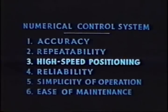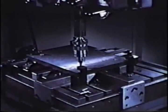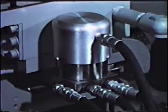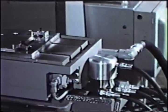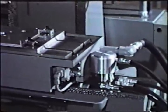High-speed positioning is another time and money saving feature of the Sperry numerical control. The Sperry control can actuate a table, carriage, or tool post at speeds up to 200 inches per minute. It can maintain its positioning speed right through to the final position where it is hydraulically locked — no special clamps being required. The Sperry control has been designed to accommodate all travel speed requirements of normal shop practice. To achieve high-speed positioning without sacrificing accuracy, Sperry has developed a special electro-hydraulic valve — an exclusive Sperry development that combines the high performance achieved by similar valves in missiles and aircraft positioning systems with the rugged durability of an industrial long-life hydraulic valve.